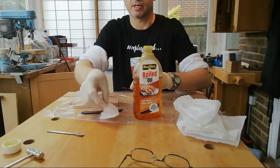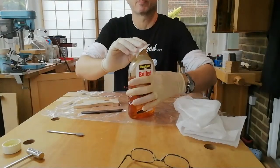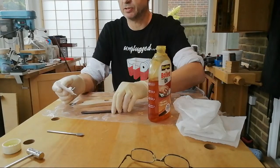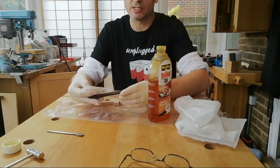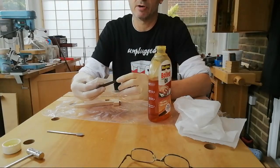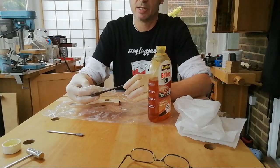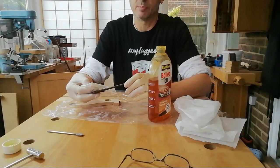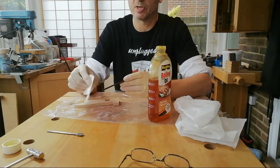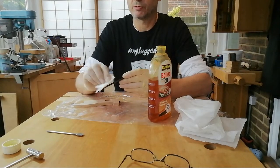It's really easy to apply. As far as the wedge goes, I'm not going to apply it on the top and underside of it because I want a bit of friction against the iron and against the body of the plane, so the wedge doesn't come out. We can always remove it with some white spirits if it does soak through from the faces.